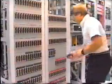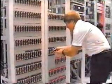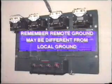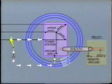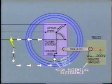You should always take extreme caution when dealing with grounds. Never disconnect a ground connection, as your body may then provide the path for ground currents. All cabinets and metallic structures in a station are normally connected to the station ground mat and are ostensibly at the same ground potential. However, certain incoming cables such as communications circuits and pilot wire circuits may be referenced to ground at a remote location, and that remote ground potential may be different from the local station ground — particularly exaggerated during a line fault when ground current flows through the earth.